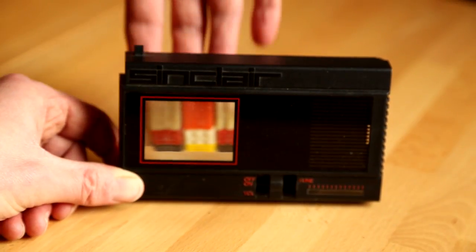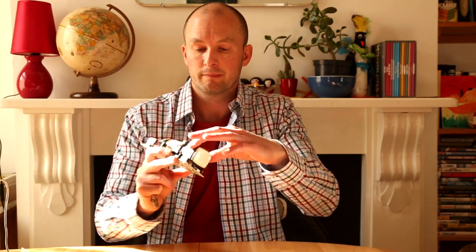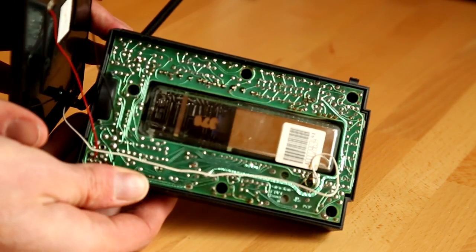The other design feature to mention about the flat screen TV is that it used a times-2 magnification lens in front of the CRT. Here's the prototype oscilloscope with the normal CRT — there's your screen, and the lens is set in front of that. This meant they didn't have to make the tube as large, so it used less power, and the beam wasn't deflected quite as much, so the trapezoid distortion was less severe — meaning less compensation, less added circuitry, and fewer problems.